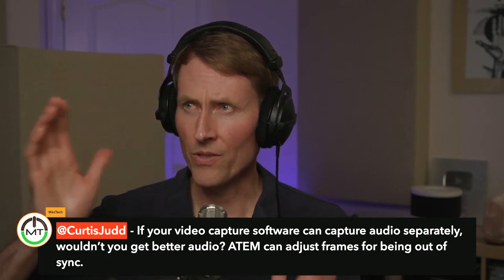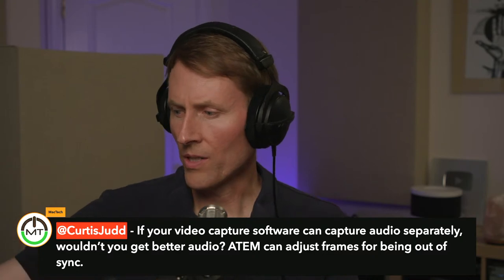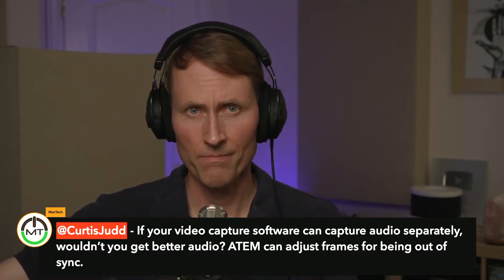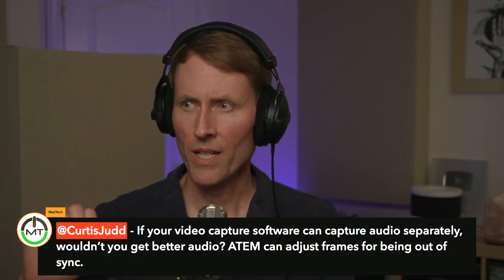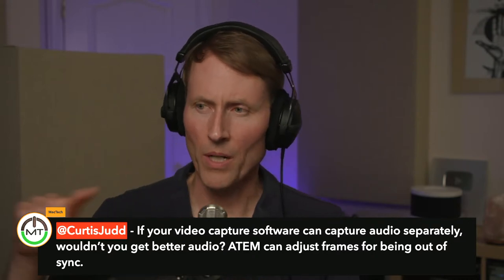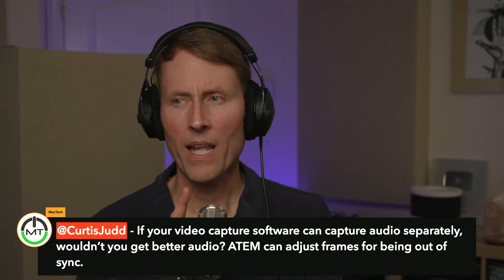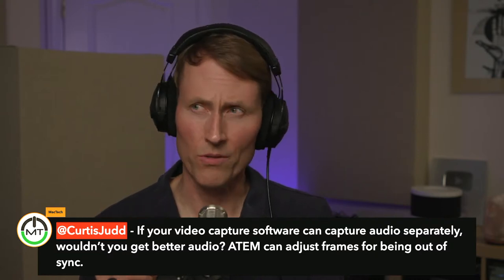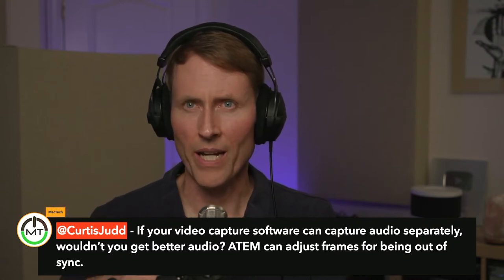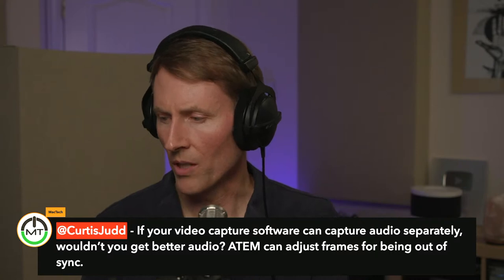We applied, after doing some testing, where we actually recorded the output. So we used the HDMI output of the ATEM Mini Pro and recorded that to an Atomos recorder. I then brought that into my computer. And what we recorded is just me clapping. So we brought that into the computer to see how far out of sync the clap was with the sound that we were getting. And where we ended up was 4 frames. So I had to slow the audio down by 4 frames in essence, and that gets it back into sync with the camera. So that is a really nice feature here on the ATEM Mini Pro.